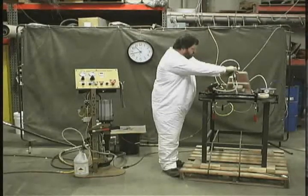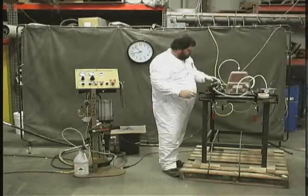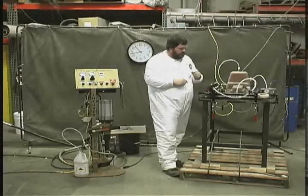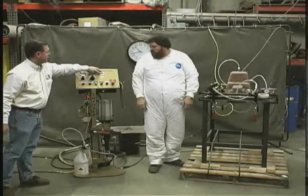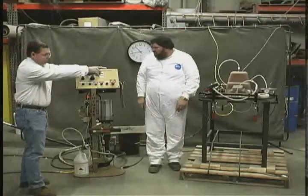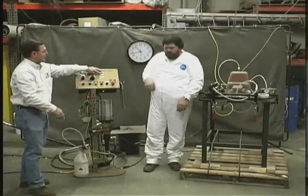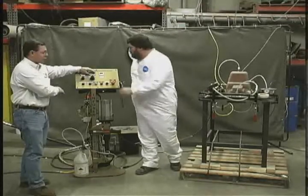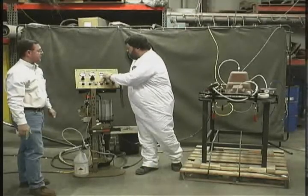Don's got the gun connected, he's switched the catalyst on, and he's opened the line to the mold. Now he hits the start button. With the RFID tag in place, the infuser read the tag — you can't see it in the film but there are 12 counts, now down to 11. You saw it hesitate — what was happening there is that the injection pressure control device at the end of the static mixer was controlling the pump speed, taking over from the regulated control and setting the speed, which he's just checked is 1.6 liters a minute.